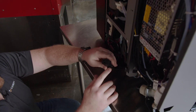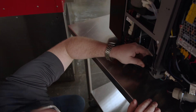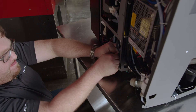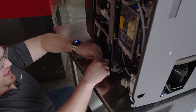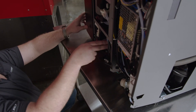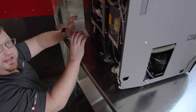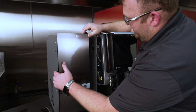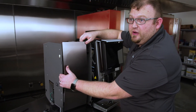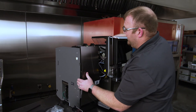You'll notice that there is a female plug, and on the back of the main unit there is a male adapter, so you just want to make sure that you're properly aligning the two. After you have it fully seated, you want to take the remaining cable and make sure that it's staying clear of the cavity in the back — that's where the waste bin protrudes through, and if there's anything blocking that area, you won't be able to get your waste bin fully seated and the machine will create an error. You can see the pin sliding into the slot, and that your cables and your silicone hose are free of any obstruction. Tug a little bit on the silicone hose to make sure that it's still free and clear as you bring them together.